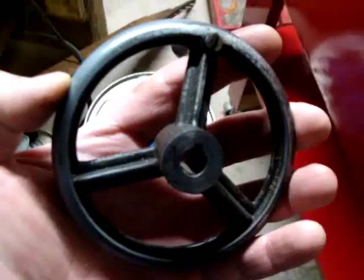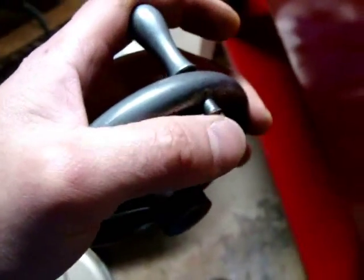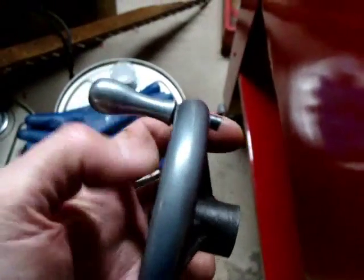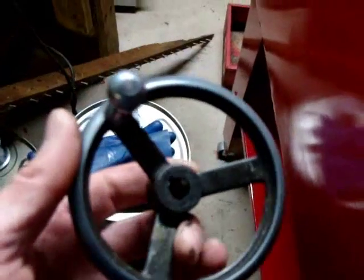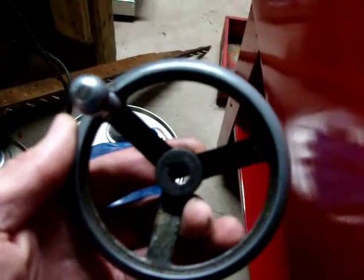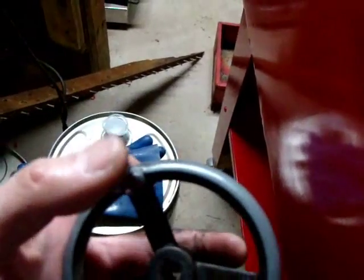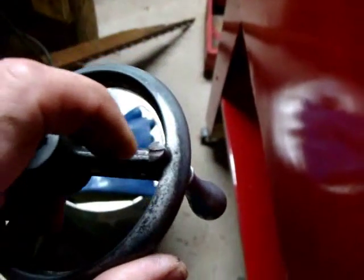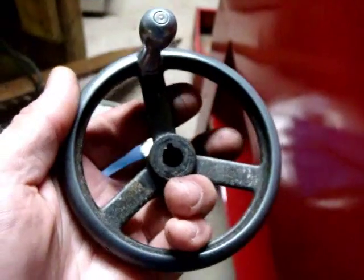I'm going to take off this locking nut and another nut behind it. I removed the hand wheel. Interesting thing — this handle part on the hand wheel is actually loose. On an early parts diagram for an Atlas lathe, there's a separate part number for this handle piece and a separate part number for the hand wheel itself. So if your hand wheel was good but you broke off the handle, you could order just the handle separately. This one appears to have just been stuck in there and the back side is almost peened or filed over to keep it in.